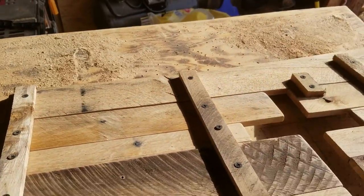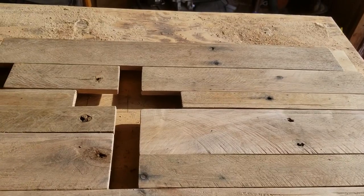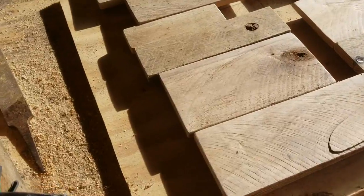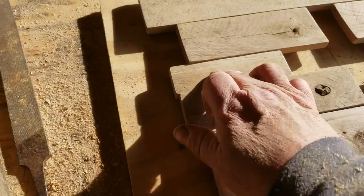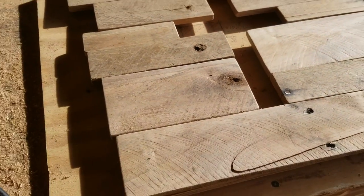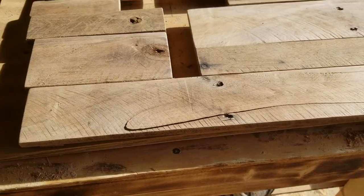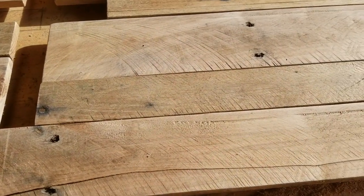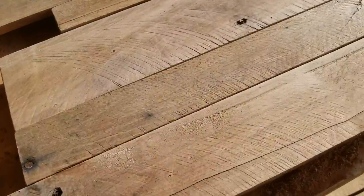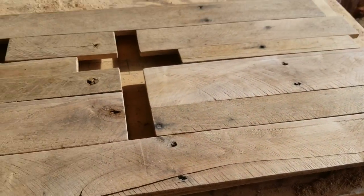The wire is the best way to hang it because you don't have to worry about lining up with studs — it's one size fits all. When you use thinner wood like I did here and sink the screws, sometimes the screws will come through. What I usually do is take my file and file them down so they're not sharp and don't show anymore.